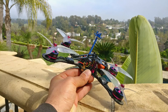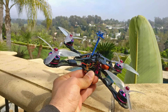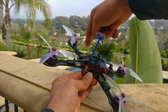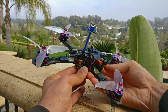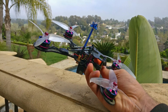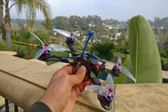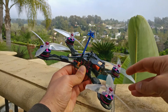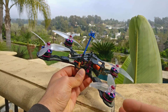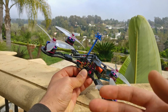The flow of air over the craft does affect the rear props. The front props are pretty much always getting clean air because they're moving forward with nothing in front of them to disturb the air. So in the traditional configuration — front props counterclockwise, rear props clockwise — the most effective part of the disc for the front is the outside, and the most effective part for the rear is the inside. That's problematic because the most effective part of the rear disc is getting all the disturbed airflow from over the front and middle of the quad. Additionally, the front props are causing more turbulence on the outside, making it more difficult for the rear props to be effective on their outer disc area.